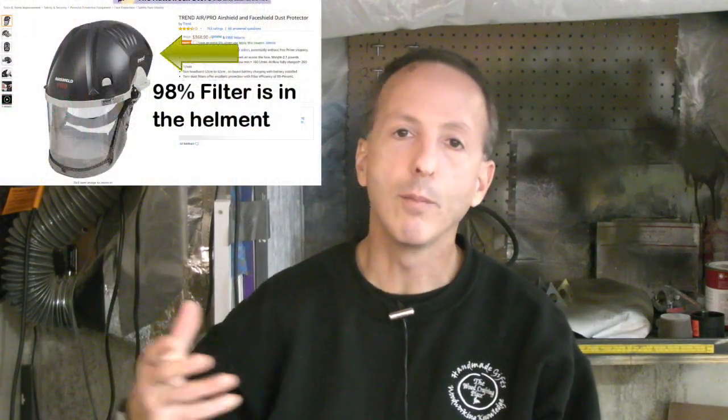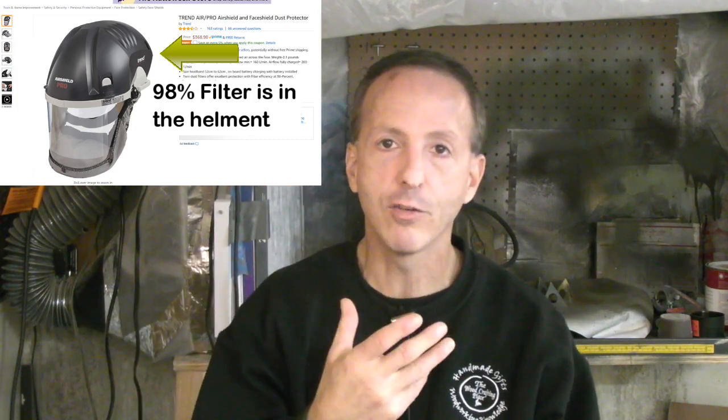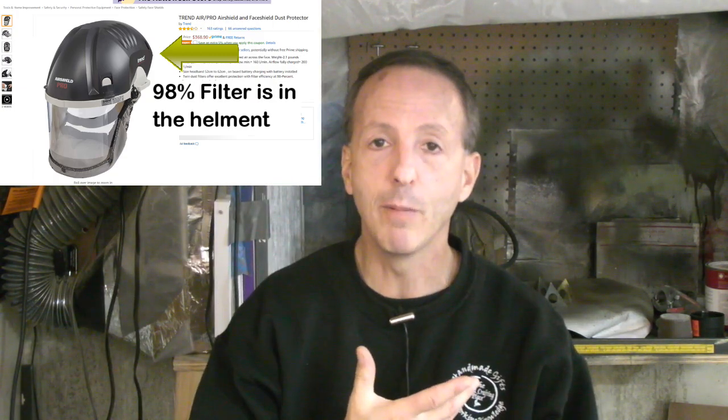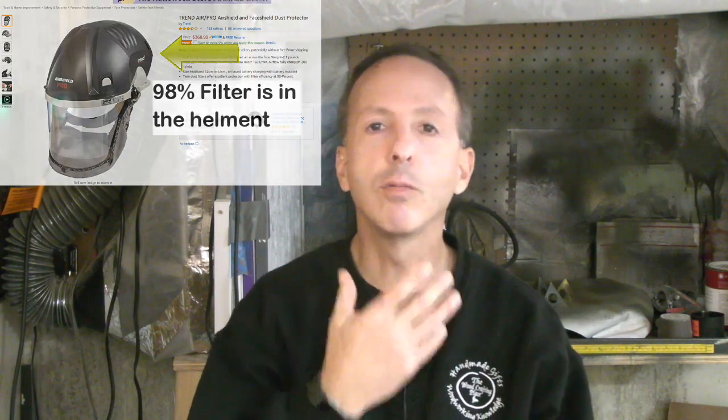They're positive pressure options, and what they have is the filters either on top of the head or on your belt, and there's a pump. There's actually a pump that pulls the air in through the filter, and then it pumps it and provides a positive pressure inside a face mask. That shower of air just pours into the face mask. Positive pressure prevents any contaminants from going into the hood. Especially with people with beards and such, this is a great option.